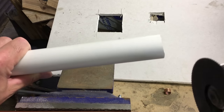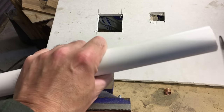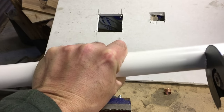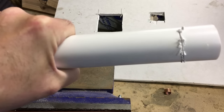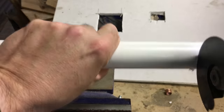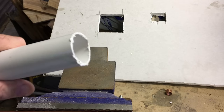Another one still with plumbing: a plastic waste pipe can be cut really easily with the multi-tool. You can see how quick it cuts. If you take your time you can do it really neatly and then deburr the pipe.